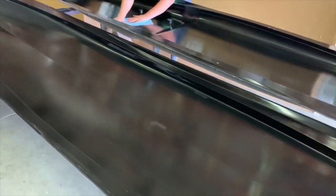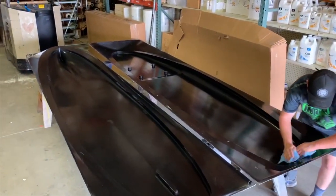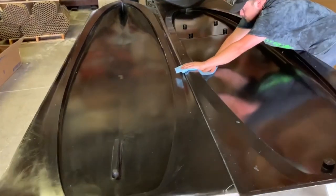In a test panel, we're going to set up a similar laminate stack and similar distances that we want to flow in the part, and then run it. That's why in this part you're going to notice it's narrow, but we're flowing in the long direction because we want to see if we can flow that resin 40 inches or so. On this part, we want to feed from one end to the other instead of the middle, because we don't want the print of our feed line down the middle of the board — we want to feed off the board itself, across to the other side.